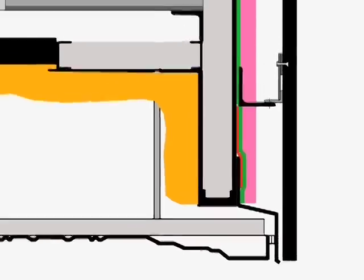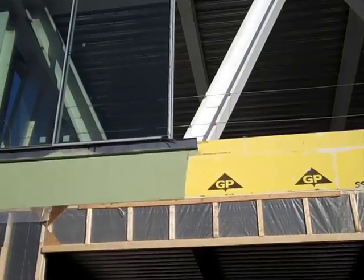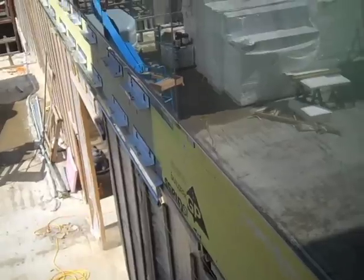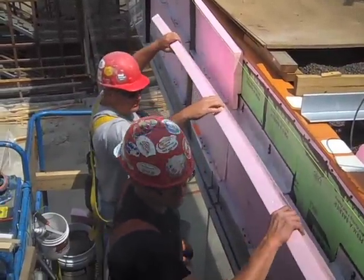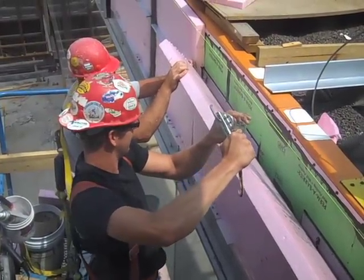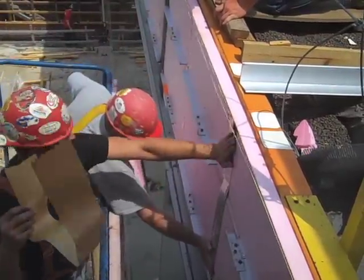That gives an overview of the enclosure system. Back to the actual construction process — here we see the glass being masked so that the air barrier can be sprayed on. Once in place, the air barrier is marked up to show the position of studs so that clip angles can be screwed into them. At this point, rigid insulation is attached directly to the air barrier. It needs to be cut to fit around the clip angles. Then a special purpose adhesive is used to actually attach the panels. A metal tape is pressed in place at the position of the open stone joints.